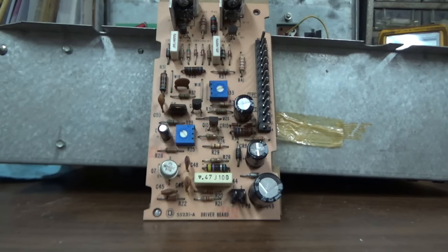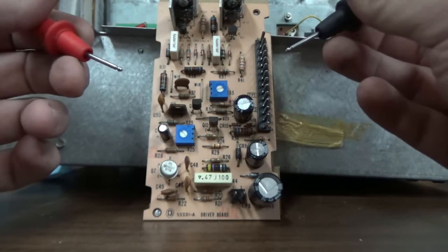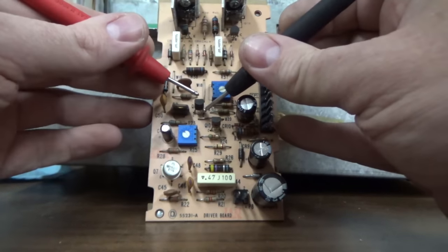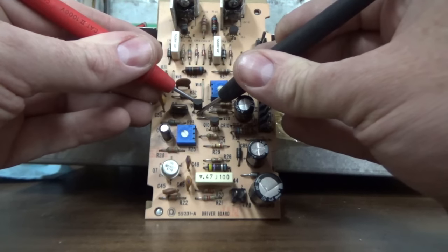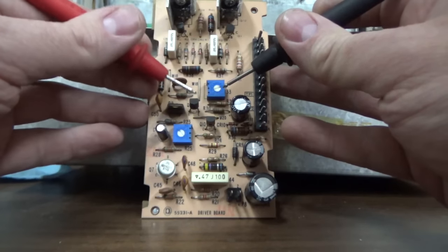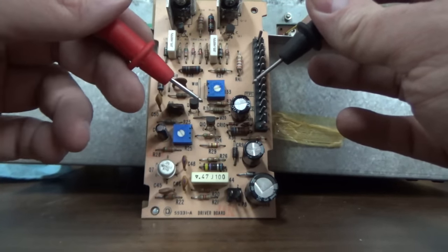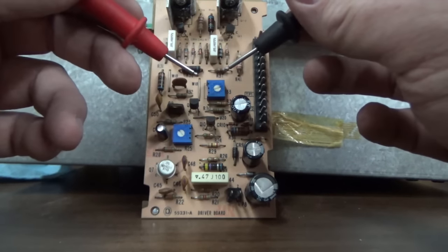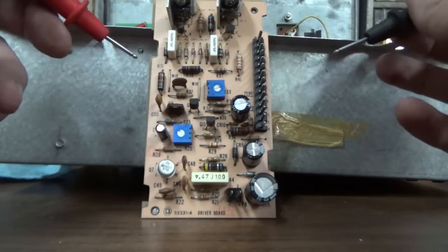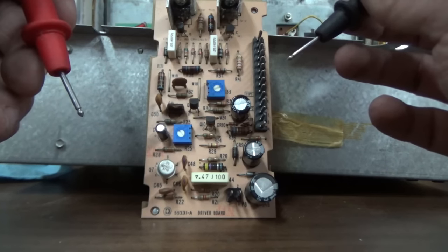Here is the board that I was assuming was for the left side. My multimeter's on diode check. Hear it? This transistor shorted. Now it could just be something else on the board that's shorted, so we're going to pull it out and check it out of the board. Keep in mind on the other one, these two had been replaced. Seems like we found something.